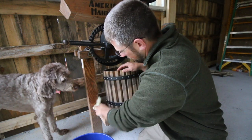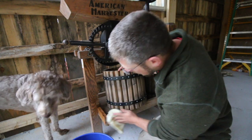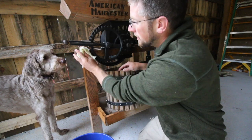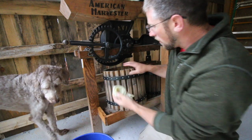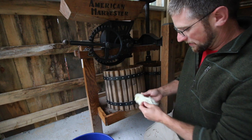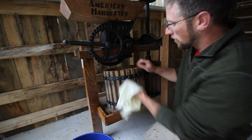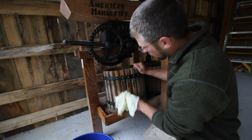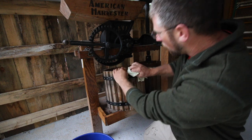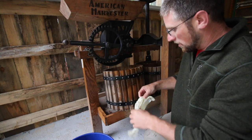Most of the wood is just unfinished. We just want to clean it up - it's been sitting around for a while. When you're using your cider press, you want all of this to be already wet and swollen so your table won't drip as much, and your baskets will have already absorbed the water so they won't be absorbing the cider. We'll clean everything up today with this nice solution, let it dry, and before we use it we'll make sure we hose it down and soak the wood nicely.